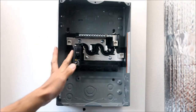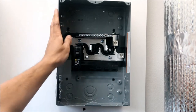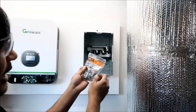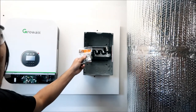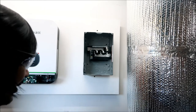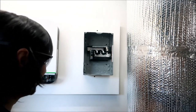That's probably why we have to have it off the wall a little bit — because these screws stick out the back. There shouldn't be anything else touching the back of the box, because the box is grounded. If the hot wire touched it, you'd get a spark. So I've got these non-metallic clamp connectors for a half-inch knockout. This puts it in there and clamps down on the wire so it doesn't get accidentally pulled out.